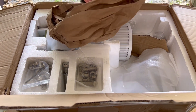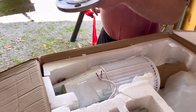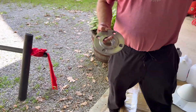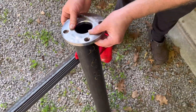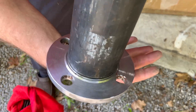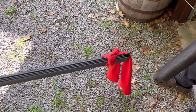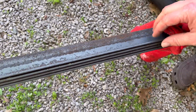I think this is the weld-on flange. They did inform me prior to getting it — they said ideally you'd want some schedule 40 or schedule 80, 3-inch diameter pipe. So that would weld on right there, and there's still plenty of space for the bolts. That's going to weld about midpoint here. I'm using angle iron — I'm going to build a four-legged tower, using inch and a half by inch and a half by three-sixteenths thick angle iron. So that flange is good.